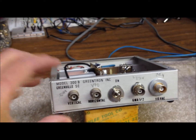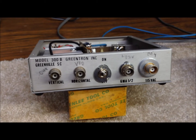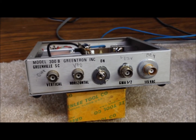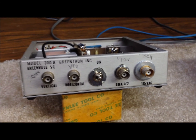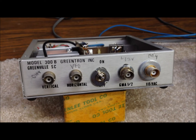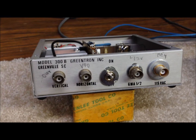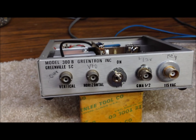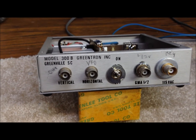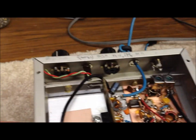Let me flip this around and take a quick look at the back. Connections on the back — there are basically only four connections to this transmitter. There's 12 volts applied, and in addition the 17 volts fed in from the front for the amplifier. There's a key jack on the right, an on/off switch for the 12 volts, a VFO input, and the far connector on the left is our output connector. All these modules are built very similarly.